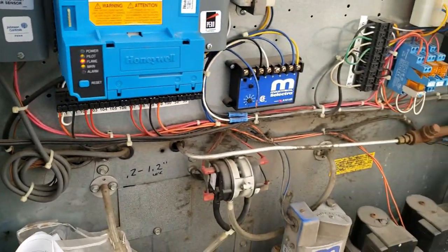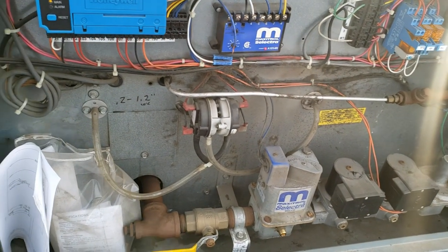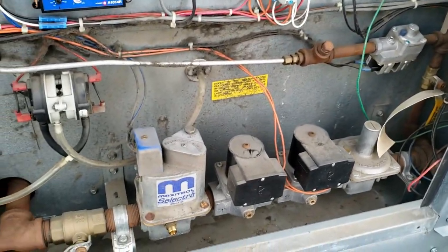I'm going to grab the handheld to check what the fault code was. This unit does have a shutdown after so many minutes where it'll lock out or go blank — I need to see if that's the freeze protection or something else. Let's run this thing for a bit and see what we get for temperature rise. Turning it back on — you can see the pilot come on, then the minimum burner fires, and now it should start modulating.